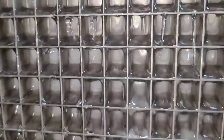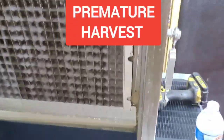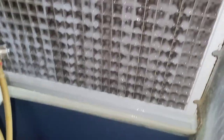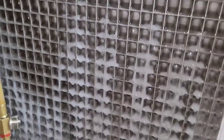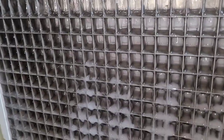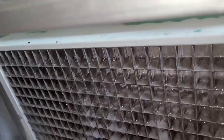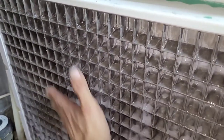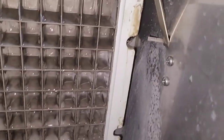Now we've got ice, but we don't have a good ice pattern — low on refrigerant, like this. In case you didn't know, it goes into defrost and then it doesn't come out of defrost until that switch turns off and on — it does that by the door opening and closing. It's supposed to make a nice even sheet of ice so it all slides off together; it pushes the curtain open and activates the switch.